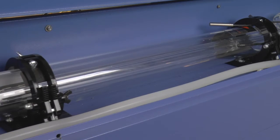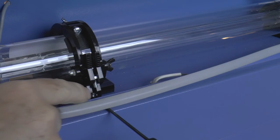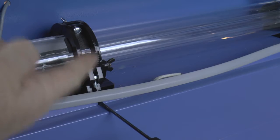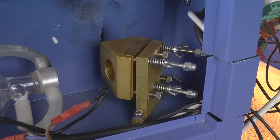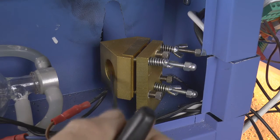Before we start our line-of-sight setting procedure, I've got my adjustable tube clamps fitted. I've got screw adjustment which allows me to wind this in and out by three millimeters, and I've got an adjuster which allows me, if I undo this wing nut, to lift the tube up and down by plus or minus three millimeters as well. So both clamps are set in their nominal position of x and y. Hopefully if I've got my design measurements right, this bit here will be in line with this bit here.